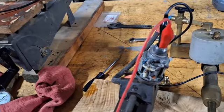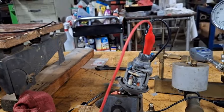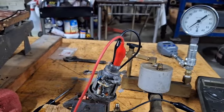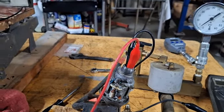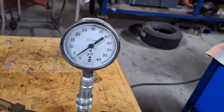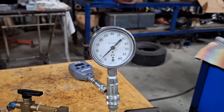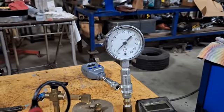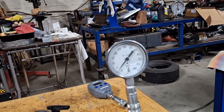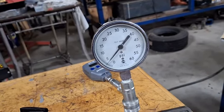This is the low fuel pressure warning switch from a T6 or a Harvard Mark II. It has a low pressure warning switch that is supposed to turn on at about two and three quarters to three pounds pressure. I've got my multimeter hooked up to it on the buzzer scale, and I put a more accurate analog gauge on — it's a little easier to read since the digital one only reads in one-pound increments. When I decrease the pressure, that's at about two and three quarters pounds — the buzzer's going. And when I increase the pressure slightly, it goes off. So this thing is adjusted correctly.